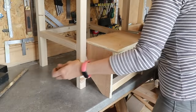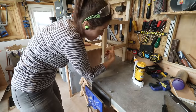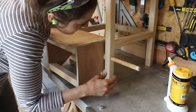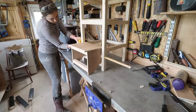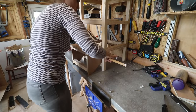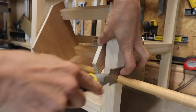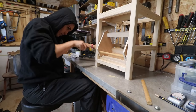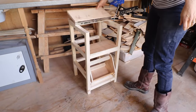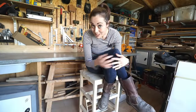We're at the stage where we can fix the step in place. I pushed one slightly out to put the glue in there, pushed the sacrificial bit of dowel out, popped it in the other side, and pushed it back through. This is purely to allow it to pivot, and once it was completely dry I flush trimmed it and went over with a sander again. I absolutely love it!